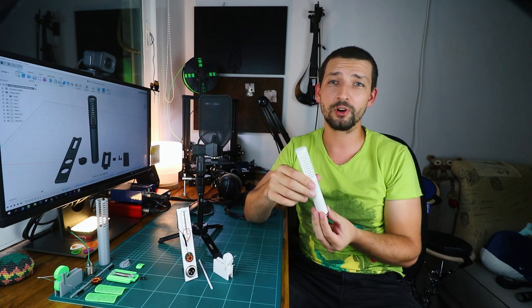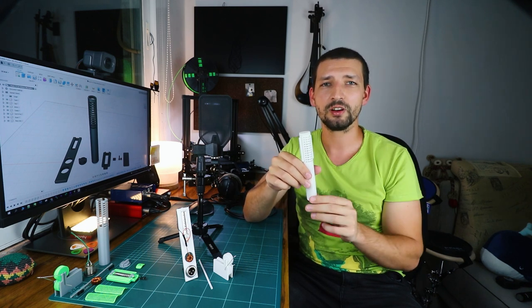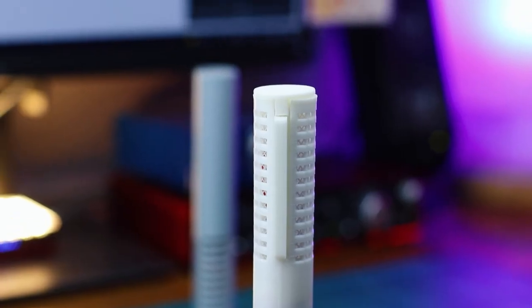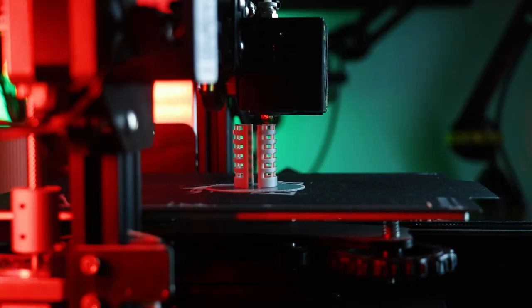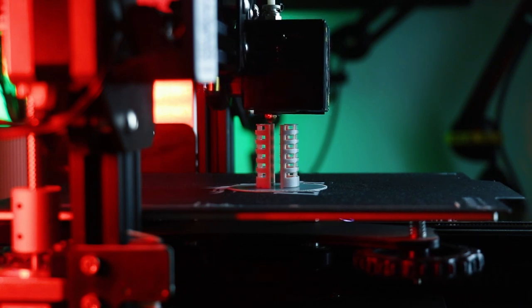Anyway, if I remember correctly, in my model the tube is a bit thicker, the grills are a bit wider, the grill slots or grooves aren't as deep as Royer's, because these areas are all potentially weak points for FDM printers and how well the layers are held together. To be able to print the grills, which are basically overhangs in 3D printing terms, I added small ribbons in between to support them. These ribbons help printing the microphone, increase its strength and can act as a built-in pop filter if we increase their number.